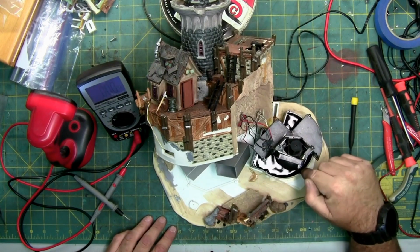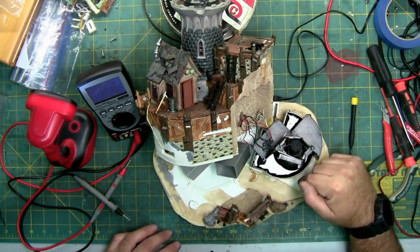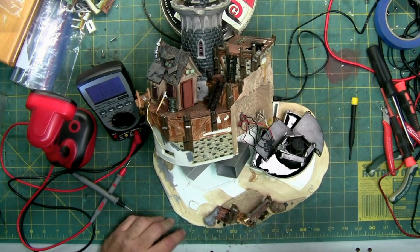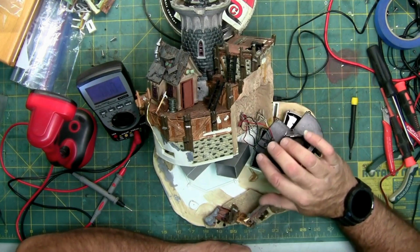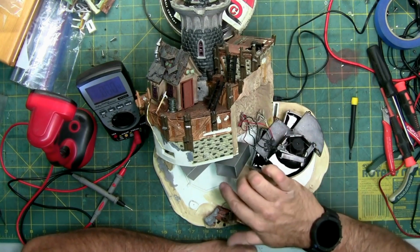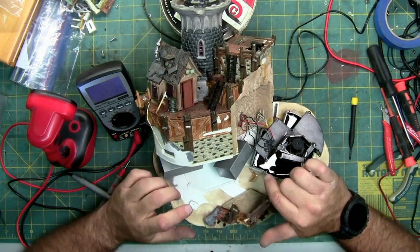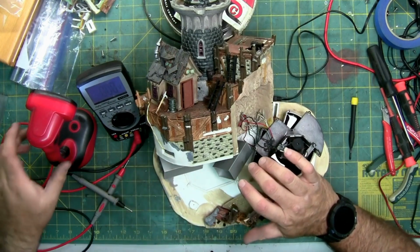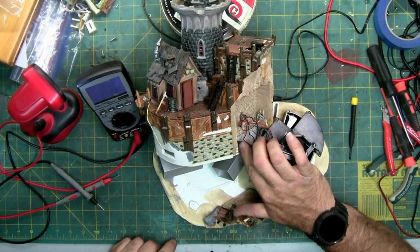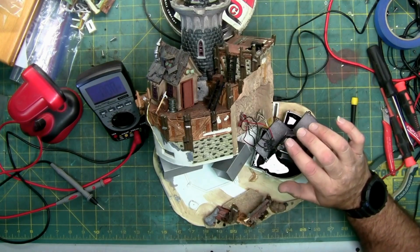I think the mister plate is bad. The corrosion, it's not leaking still. I mean, there's no liquid coming out around and the water's not dropping, which is a positive. But I think I'm going to have to cut the wire and then test it directly, since I can't get through the bottom of the board, and I don't want to heat up the board to break the glue residue off for the sealing of the board. It's easier just to cut the wire, resolder it, and re-hot glue it or cover it in liquid electrical tape to keep it away from the moisture and keep a good connection.